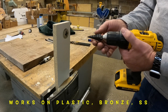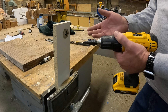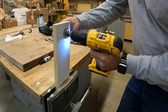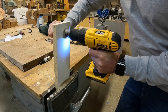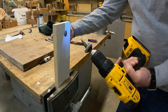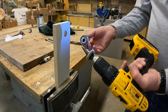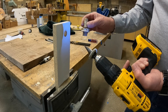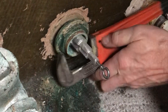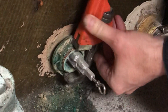If it's a big through-hull you're going to need a really big step bit, or you can actually use a hole saw — most of us have plenty of hole saws. Watch this: boom, the end comes off, push the through-hull in from the inside of the boat. It's clean, it's done — ready to order a new one. Don't worry about destroying these, they're about four bucks. Step bit is a great way to go.